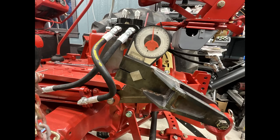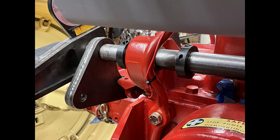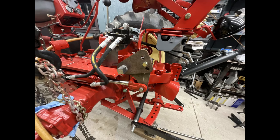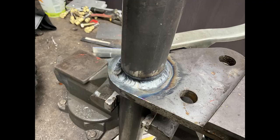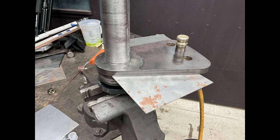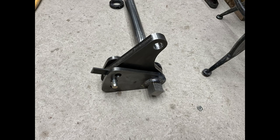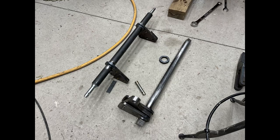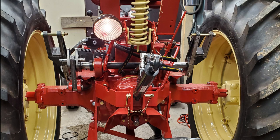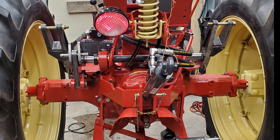The last big project was getting the 3-point hitch components installed. I backed the tractor under the overhead and removed the left wheel so I could install the rock shaft. All these parts were mocked up in their appropriate position so I could tack weld them in place, and that way I could easily remove them and finish-weld them over on the bench. The rear light was hooked up and I couldn't resist the urge to try out my first implement — a trailer mover attachment.